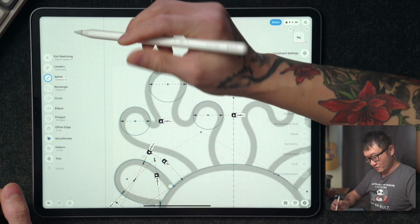Now we're gonna push this new face down 12 millimeters. Okay, let's go ahead and extrude the ear and the antler as well up to 25 millimeters. And to mirror these two over to the other side of the head, let's double click to select both of them and then come under more and pick mirror. Now we're gonna select the center line that we used on our previous sketch. And this center line is gonna create this plane that the two bodies are going to mirror about just like this. Make sure the keep originals is on and click done.